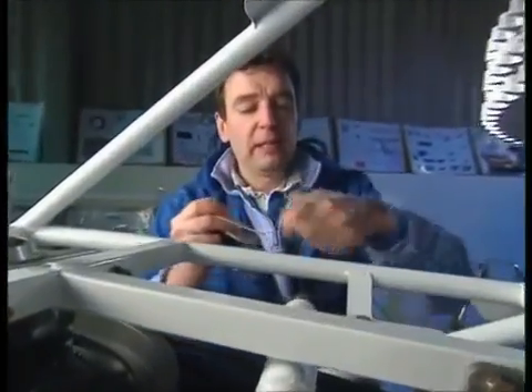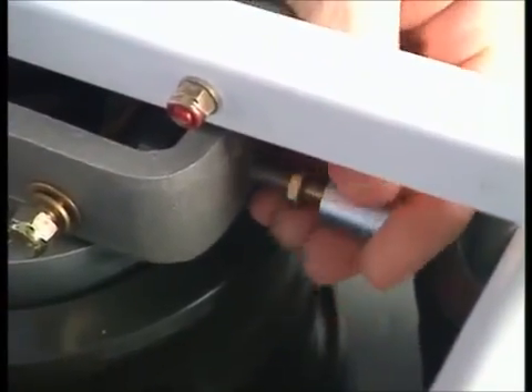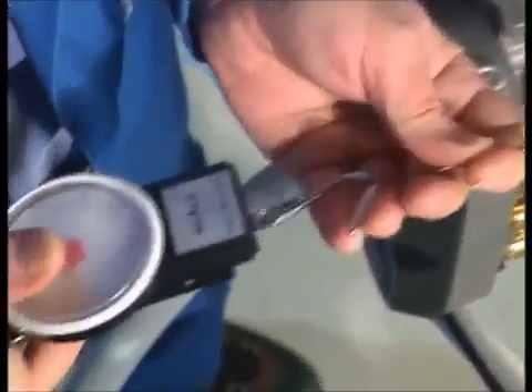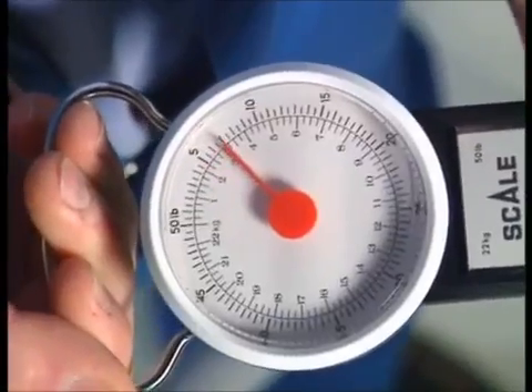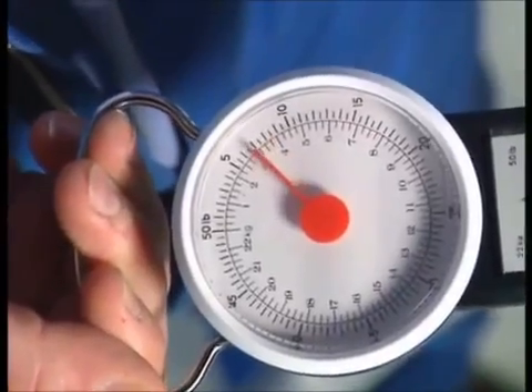You need a gauge, a bit of wire, and a little piece of aluminium cut to half an inch on the end of a piece of string — all will become very clear in two seconds. The adjustment for the belts is done down here on this bolt. As you screw this in, it pushes the top of the engine towards the front of the aircraft, which tensions the belts. That's tightening up a bit. So let's see if we're anywhere near the tension we need. What we do is get your bit of wire, hook that underneath the bottom belt, attach the gauge to the other end of the wire. This is effectively your depth gauge, your marker gauge. The belts are at the right tension when you're pulling seven pounds on here and the belt should move out of position the half inch width of this little piece of aluminium. So we've got seven on there and you keep fiddling about until you get it right.